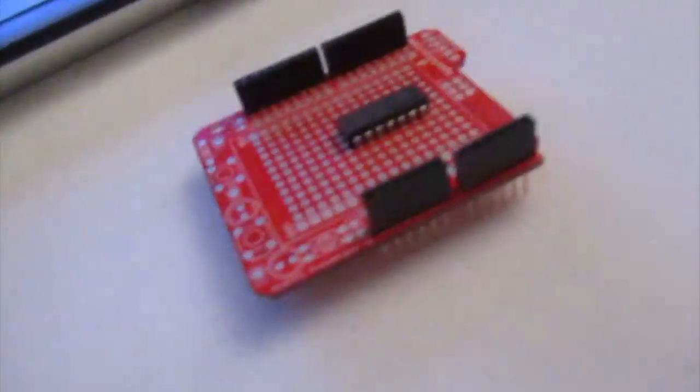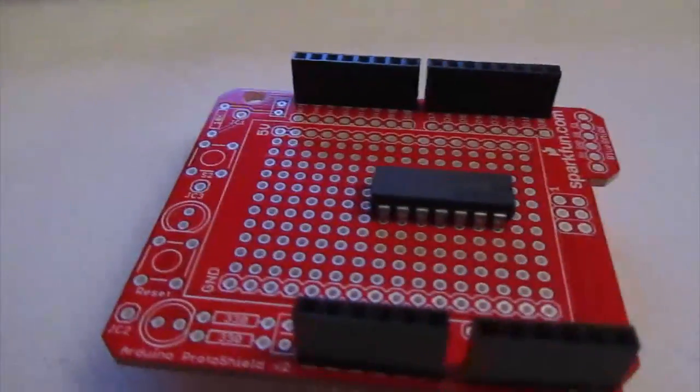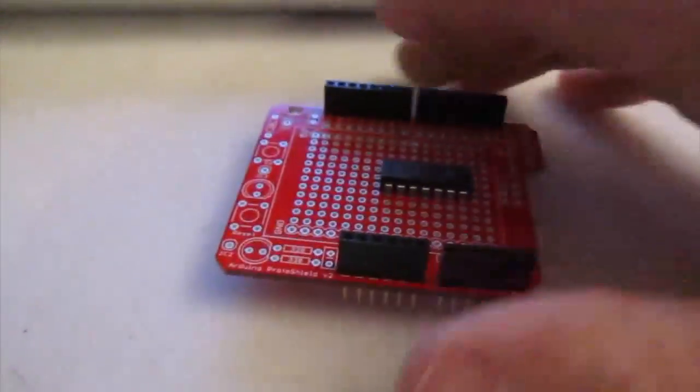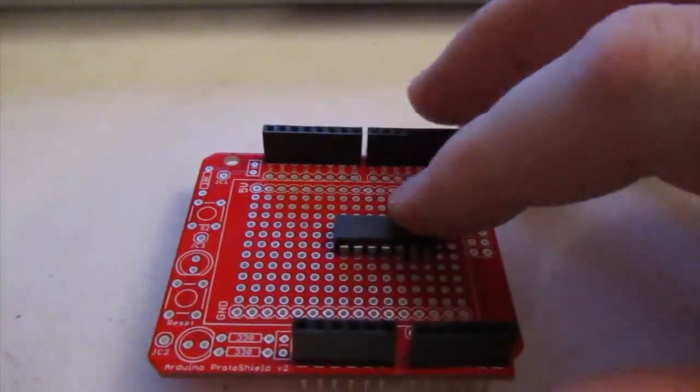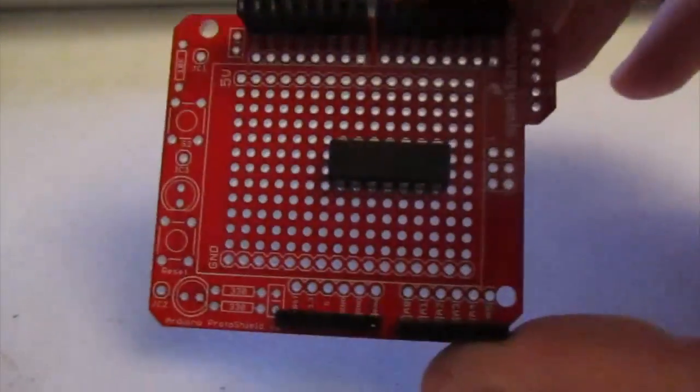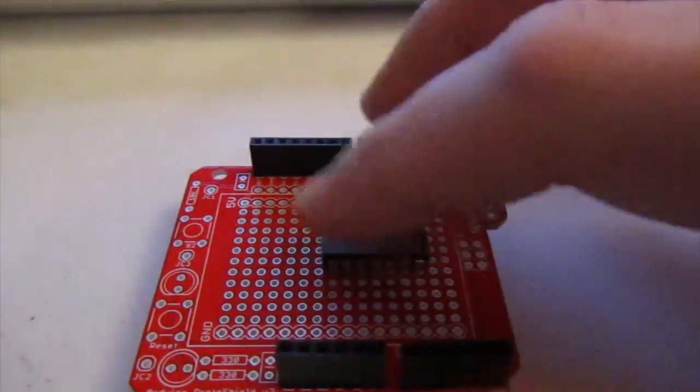Unfortunately, that's about as far as it goes tonight. I put the other TTL converter back in right there and tried to get it to work again, and no such luck. Without adding the control lines, that won't have any power in that converter, and it's just really not the way to go. So I broke out my prototype board that I bought a long time ago, and I tacked on my connectors, so I now have at least that put together. And I do have a line driver chip here.